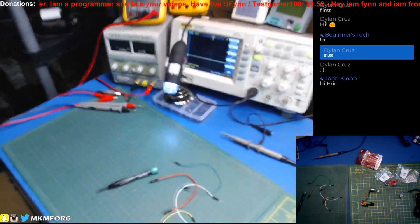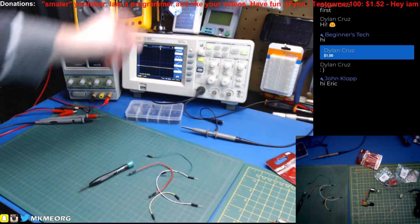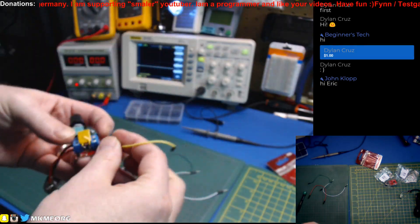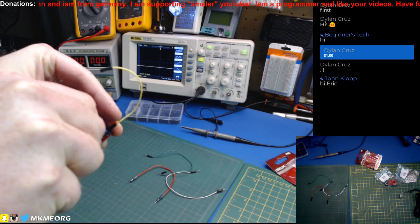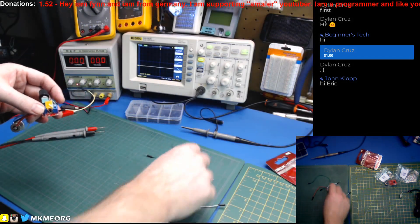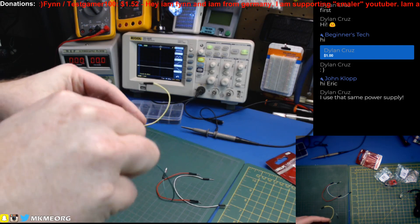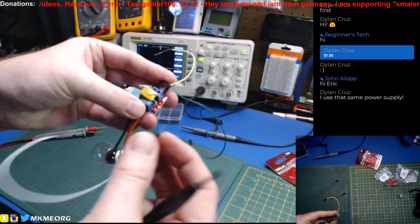Camera problems. Let's move the microscope. I think what we'll use is a couple of wires into the motor input. Yellow should be positive today — that's what we have sitting here on the bench. Let's double up the output. The input we're just going to feed power in, but I think we'll hook a second set of outputs so we can hook the oscilloscope on and see what's going on and see what the pulse width modulation really looks like. Let's back those off. These are just breadboard jumpers — you can find them in my store, store.makeme.org.